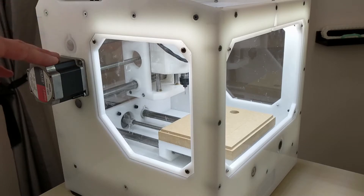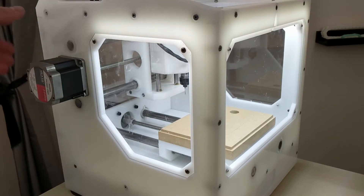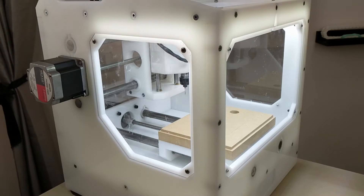All the stepper motors that drive this thing are NEMA 23 size stepper motors. They're fairly low-powered units — I think they're about 2-amp units — hugely overkill for a machine of this size, but they were from my old CNC. They're driving an 8mm 4-start lead screw. Most printers have that nowadays — easy and cheap to get on eBay.